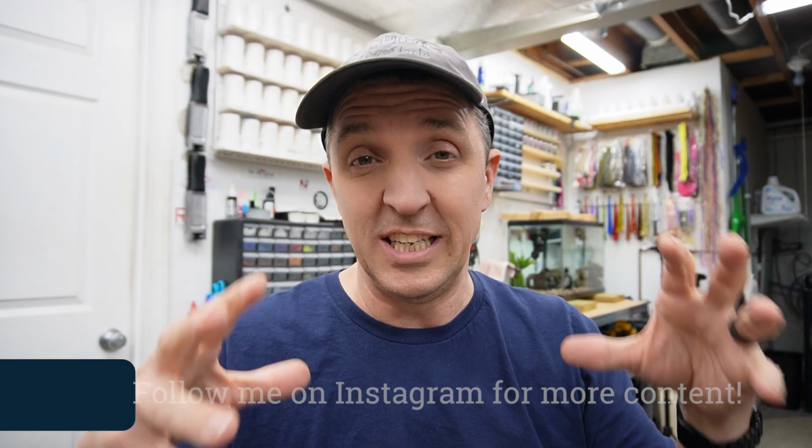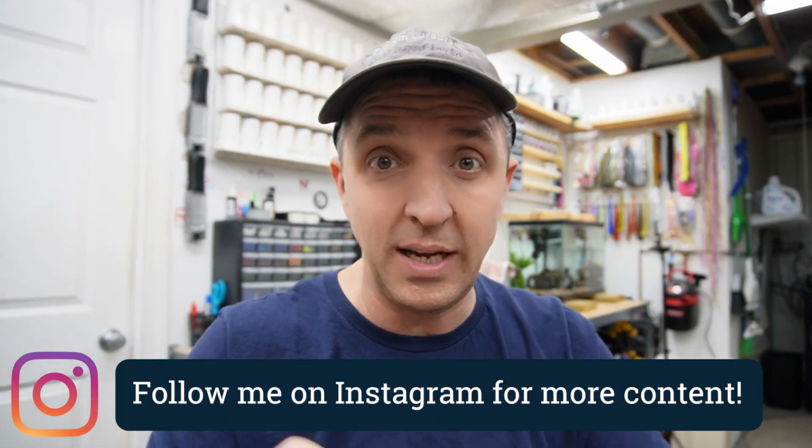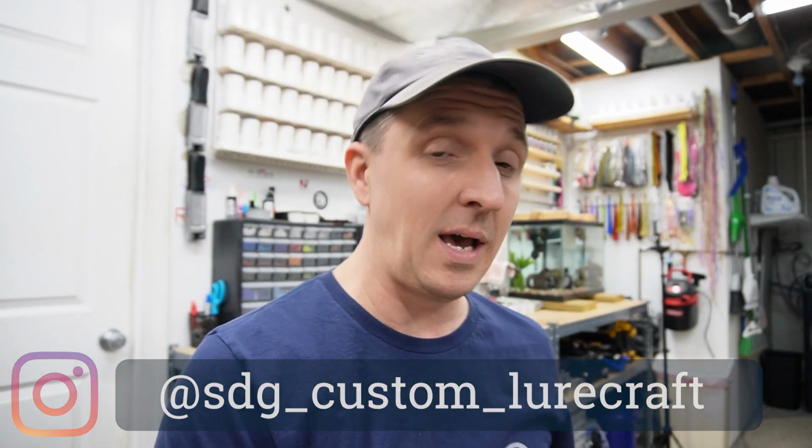It vacuumed well. I've used some plastic where, when you put it in the vacuum chamber, the surface tension of the bubbles is thick and they won't coagulate together and burst, and what you get is this pile of foam on top that you end up having to scoop off. I hate that. This is true, I think, with any Plastisol. When you use a vac chamber, you get it up into the 360s, 370s, and you vac it at that point. The hotter it is, the thinner it is.